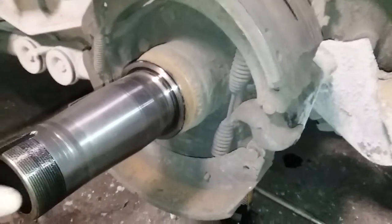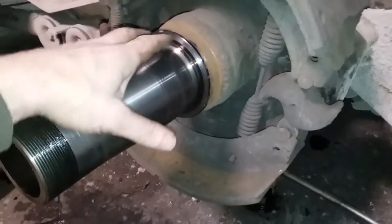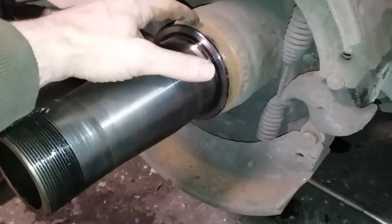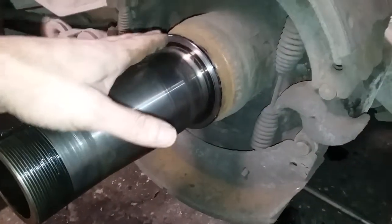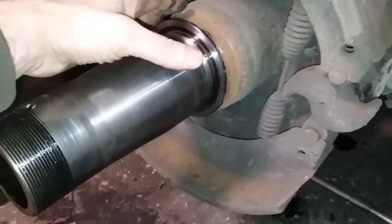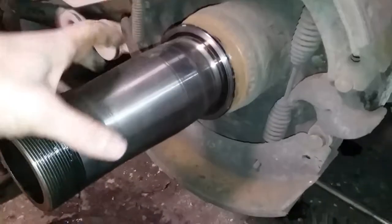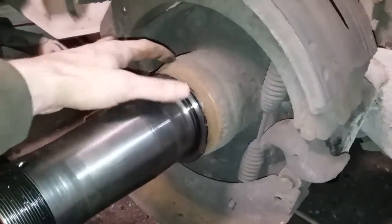You disassemble the whole thing, and a big machine boring machine bolts on here and you indicate it all around. After you cut your old spindle off and bore the housing out, this piece — they call it a seal ring — and the spindle get put together. You heat this up, slide the spindle into it, and weld around the back side of it. Then after you get done boring the housing to the proper size, you heat the housing up and slide this whole spindle in.